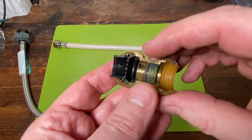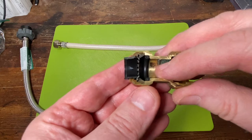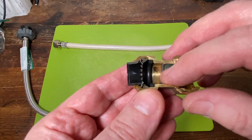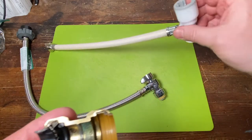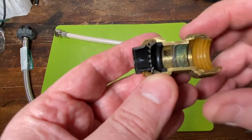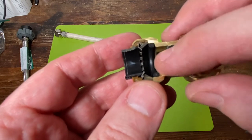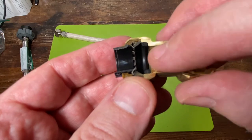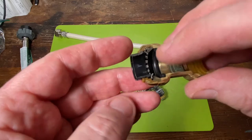Before, I had cut open a push-to-connect fitting - this is that SharkBite style of fitting. These things have been around probably 20 years or so, maybe a little bit longer. This style of fitting has been around since sometime in the 80s. But the SharkBite brand actually came on the scene around 2004, and it's just kind of dominated everything at this point. It's got an O-ring and a little metal retainer clip in there. When you push this in, it holds it in place. When you want to pop it out, you push this down, it releases and pulls it out.